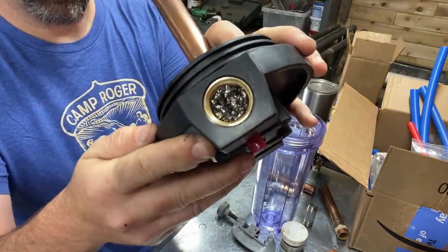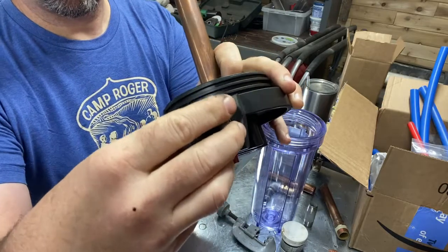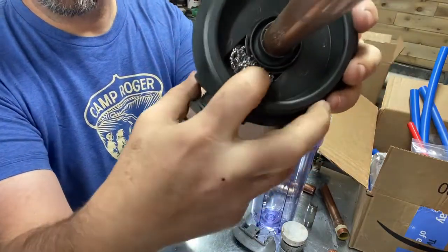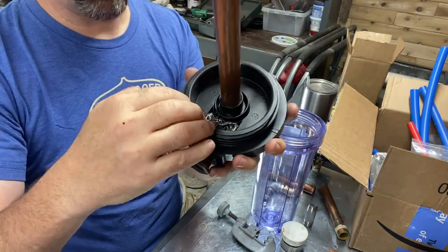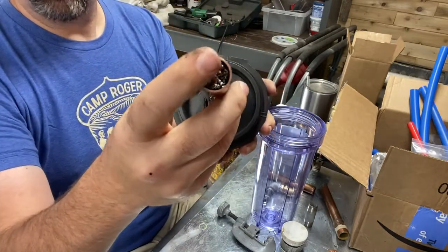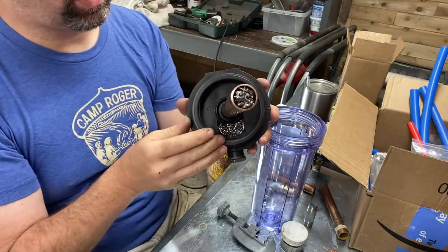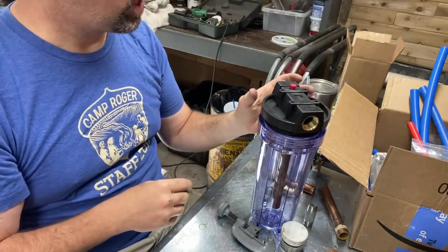I have the Scotch-Brite stainless steel scrubbies packed into the port. I'll take my pipe-threaded bushing and screw it in there, which will act as a cap trapping it in. You can also see it's packed in on this side as well. As the air flows upward toward the exit port, any beads that want to blow out should stay in the dryer instead. I also packed some scrubby into the tube. I'm not sure how beads would travel upstream of the airflow, but a little strainer can't hurt. This then simply gets screwed on to the container and the beads are filled in.